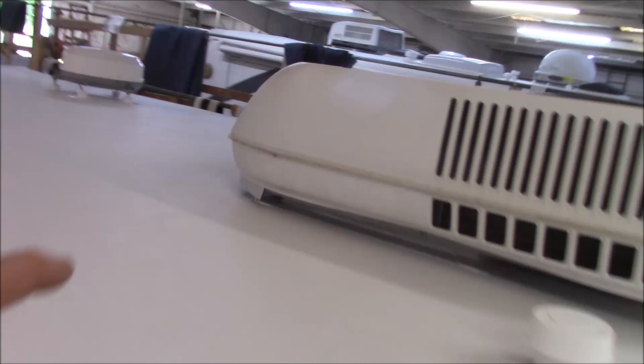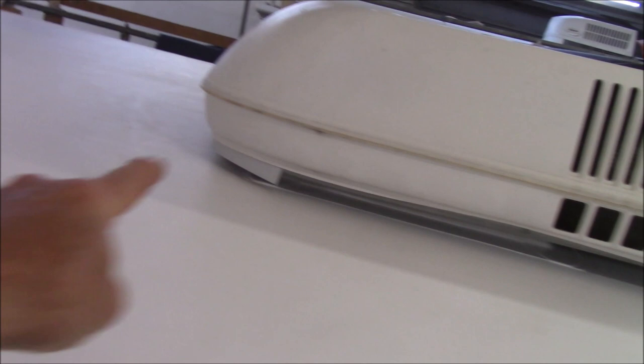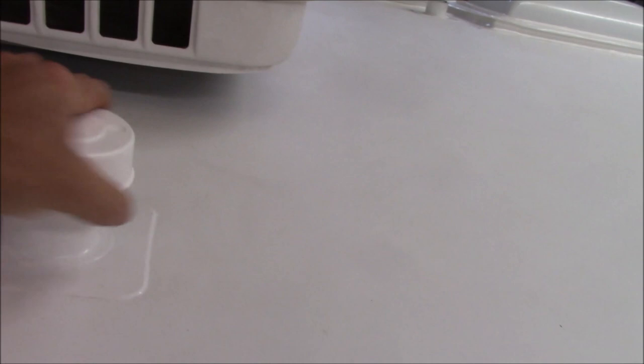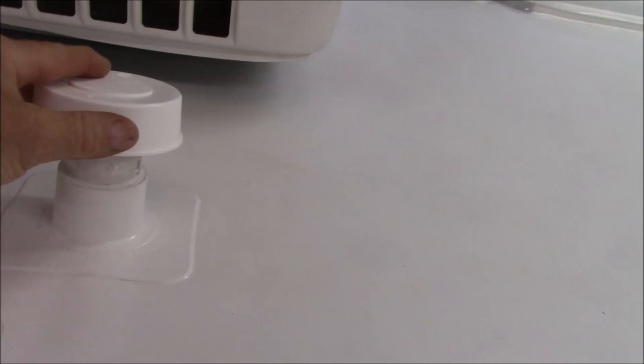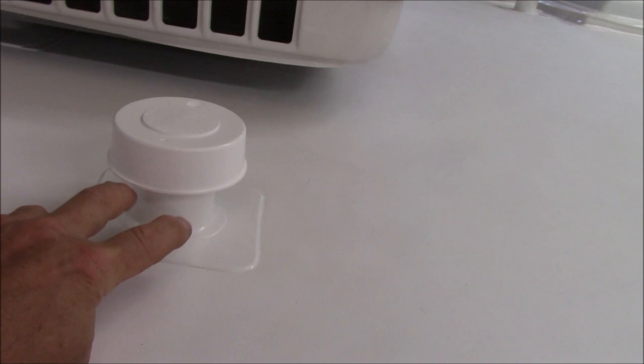We've got plumbing right here, an air conditioner here, a stand in the back for balance, and a piece of counter flash up here. Underneath is a foam gasket — we don't want water to trickle along the bottom of the air conditioner frame and get in there. That piece goes below the counter flash on the curb, so water would have to drip down and travel past it. All of these plumbing vents are sealed — even if the cap gets popped off, it's never going to leak anywhere but into the pipe.